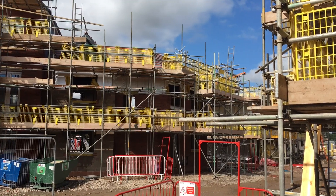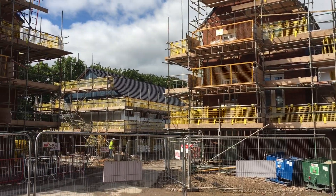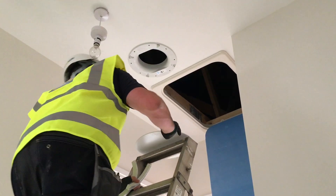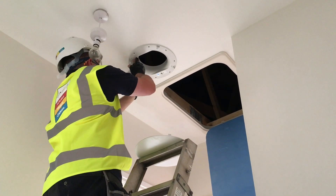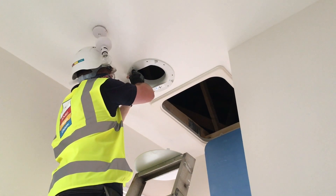My name is Mark O'Neill, I work for Lovell and I'm a senior site manager. The development is approximately 800 houses — 358 are private for Lovell's and the rest is for our client. The ventilation strategy we're using is the PIV, it's the DryMaster Eco range. The installation is a lot easier, the guys have it done to a fine art — they can put it in now in 20 to 30 minutes and we can sign it off at first fix.